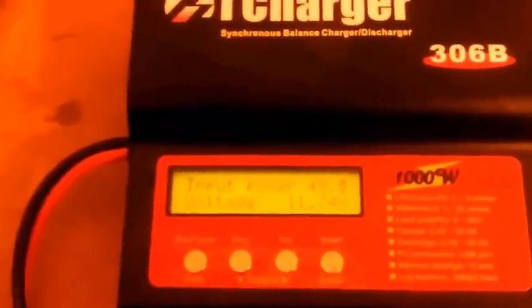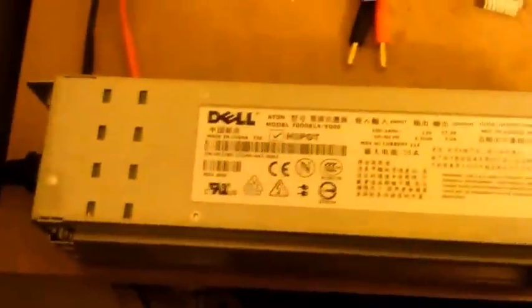This is basically proving that the power supply is working, and it has been loaded to 48 amps — about 85% of its capacity. I'm pretty sure it'll go all the way up to the rated 57 amps, but I don't have anything to load it that high. But again, this is E2, non-isolated. The next video will show E1, which is the isolated power supply. I'll do the same test, and then I'll test both of them together at 24 volts before I send it out.